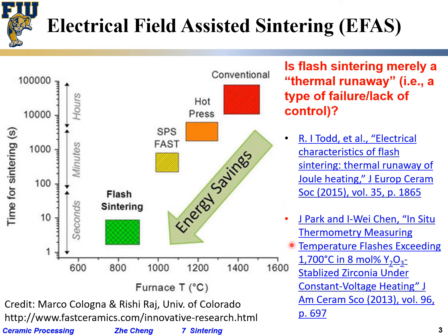Okay. And what happens for these types of YSZ material is that their conductivity increases with increasing temperature. Think again. Conductivity increases with increasing temperature, which means the hotter the sample gets, the more conductive the sample becomes. And then under a constant voltage, remember what you learned in high school physics. The voltage squared divided by your resistance is your power. The lower your resistance, the higher your power. And the higher the power, you heat up even more and your resistance drops even lower. So from that sense, it makes sense, right? It's so-called self-accelerated sintering.